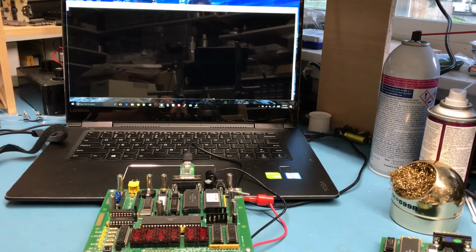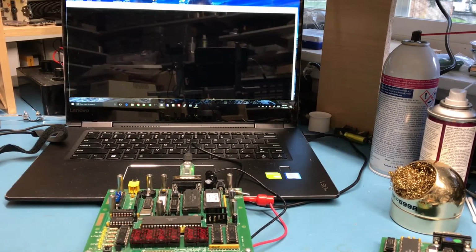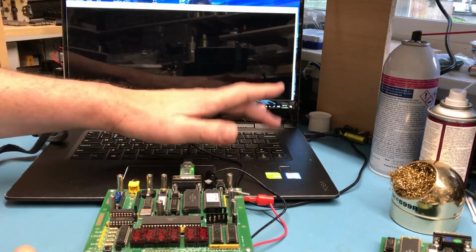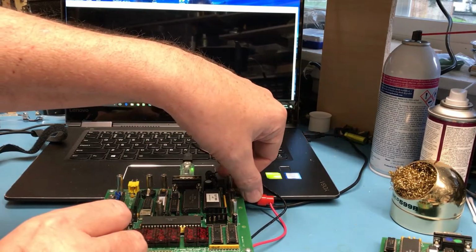I've learned in the reading here that what we're seeing on the displays when we power on is the power on self-test running. As the numbers move down here, it's running through the self-test, and it'll hit a point where it wants to do an auto baud detection, which is why it required me hitting a key on the keyboard before to actually get a connection onto the terminal.